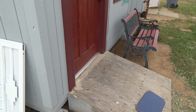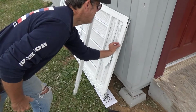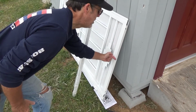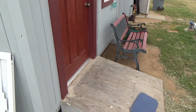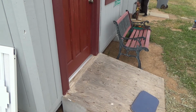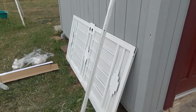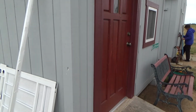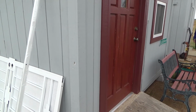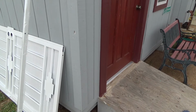Now if somebody wanted to, you could take a door sweep and you can screw it on the face of the bottom, you know, right on here, and then adjust it in or out, and then it's got a rubber sweep on the edge, and then you can push that right down to the base like here, if that's a concern of yours. Okay, so there are options as to what you want to do with weather stripping, because lots of people, they not only use this for a security door, but maybe they want to open up the door too, and you've got the door open and you just have the screen there, and you don't want any little bugs to crawl in there, or anything crawling underneath your door or something like that. So, you know, look for that kind of stuff at the hardware store.